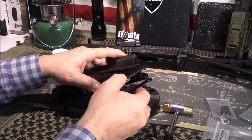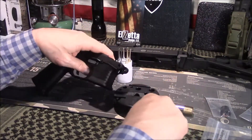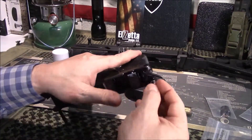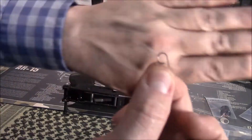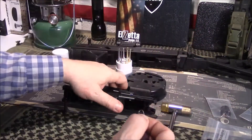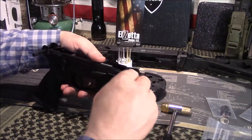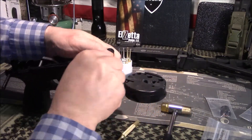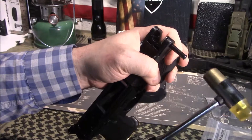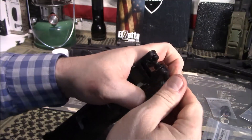This is going to be much better, I am sure. So just slide it back into place just like that — and don't lose your spring, which I just did. So you want to make sure that spring, if it does come out, it has a little curve, and this one's squared off. The curved portion is what goes down into the receiver. Then take your pin and get it started again, tap it just a little bit past the spring, and now it would capture it again — functioning like it's supposed to.